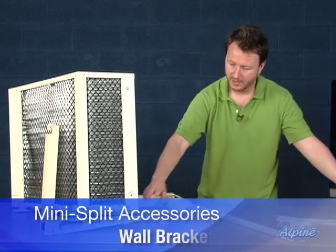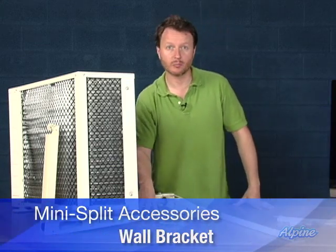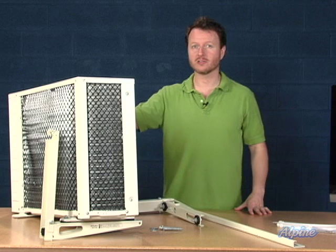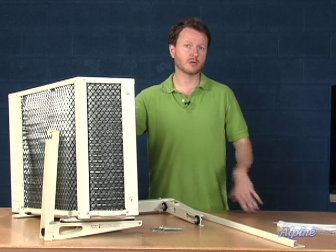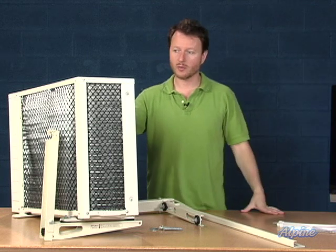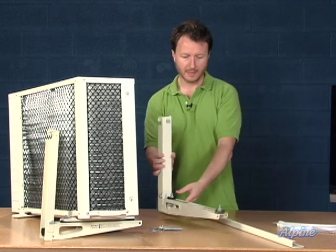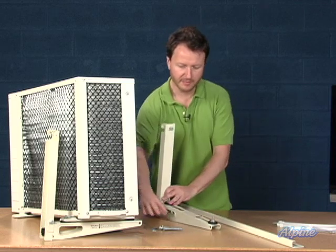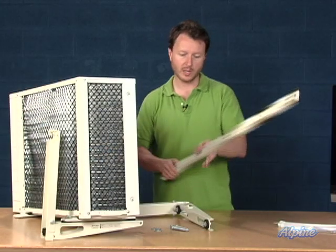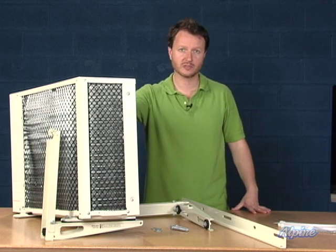I actually have bolted to the condenser right now an additional accessory — this is a wall mounting bracket so that we can mount the condenser on a wall. You would want that if you're installing a mini split system in an area where there's no place to put it on the ground, you don't have yard space, or you're putting it on a multi-story building — second story, third story, or even higher. This bracket has two pieces: one is already installed, and here's another that would go on the opposite end. We have heavy-duty bolts and washers to secure this to the wall, plus this piece which also goes on the wall. This comes in a few different capacities depending upon the size of the mini split system you're choosing.